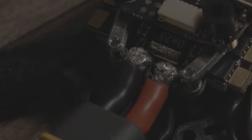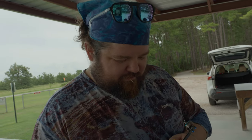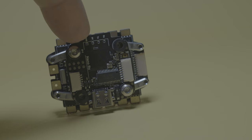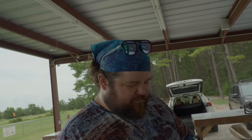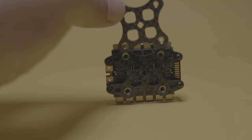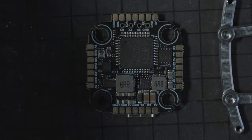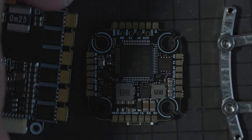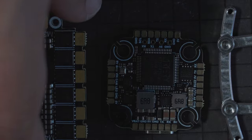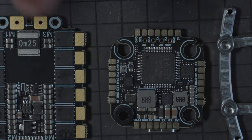Look at how close these metal parts are together — that's a little treacherous if you have a fat solder joint. I do like that it has this little cage that you can put your flight controller on. This is a new mounting standard, so you're going to have to decide if you're going to get a frame that can accommodate this. They are going to have a 3D printable jig that you can use to drill out any of your favorite frames and mount this up.